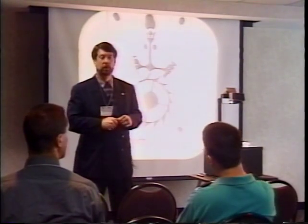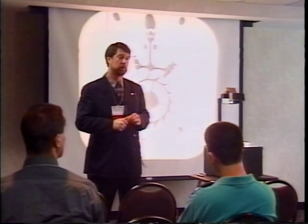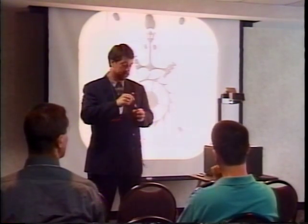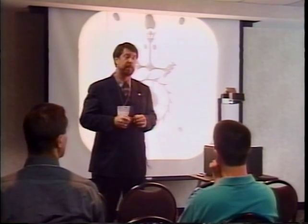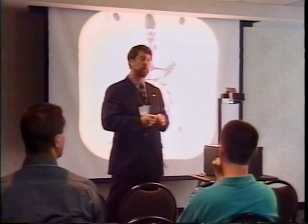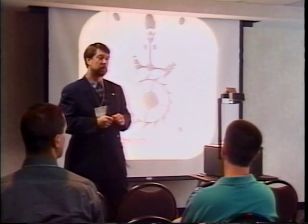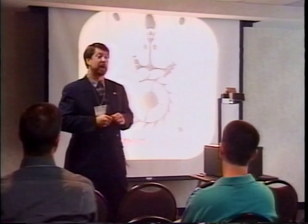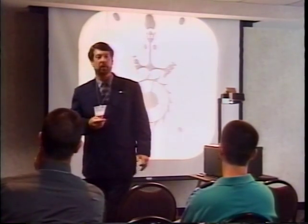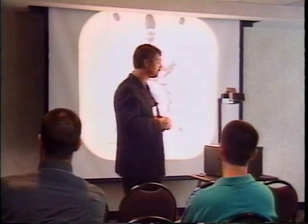We haven't really seen that end, but we also have a condition where the side shake of the pallet could be such that, depending on the position, you could see variation in the interaction with the fork and balance. So you're talking about the side shake of the balance staff in the jewel. Well, that too, or the pallet. Or the pallet, that's correct. That's true when you actually get the power up. That's a very good point. You're presuming the staff is free. Yeah, and I'm presuming that everything is good to that point.